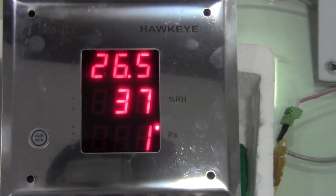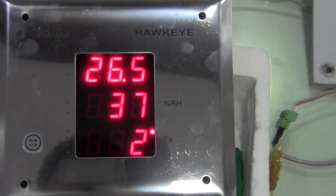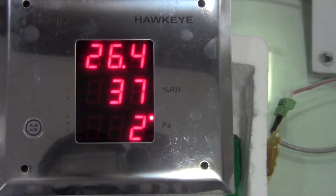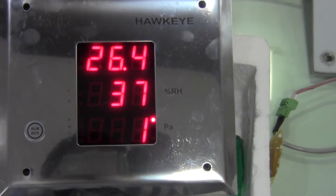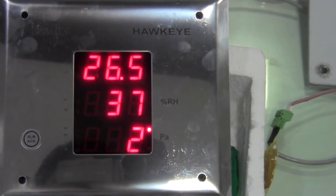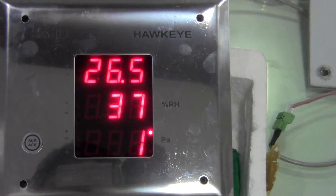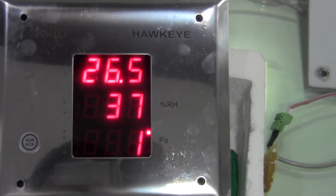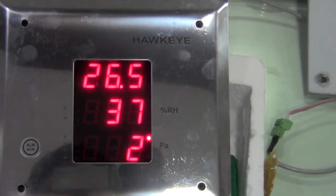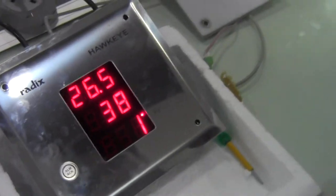At this point, the user should be able to acknowledge the alarm and shut it off. And at this point, we are also going to set the time delay for the alarm to come on again to 2 minutes. And if the temperature remains above limit, which is 26 degrees Celsius, for more than 2 minutes, the alarm will come on and the user will not be able to acknowledge the same. Okay? All right, Ramu, why don't you just go ahead and do that?